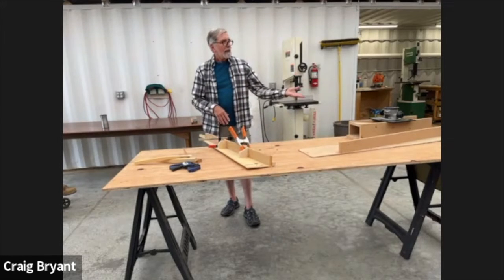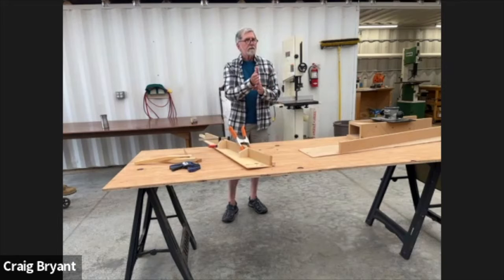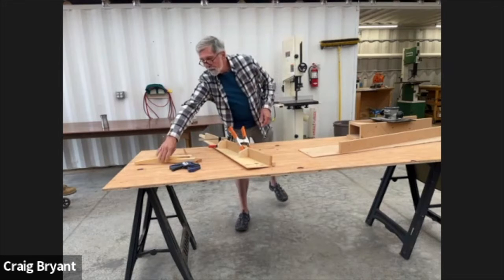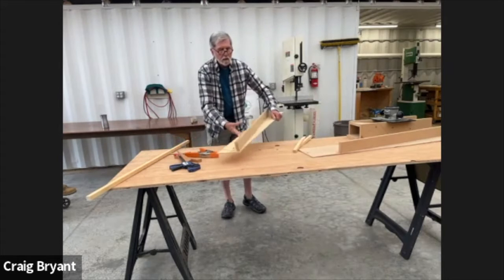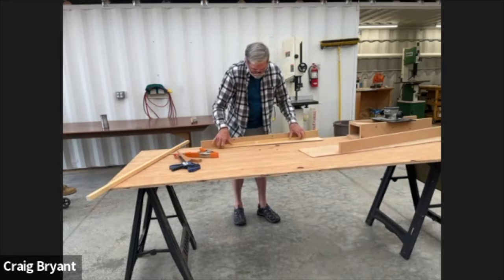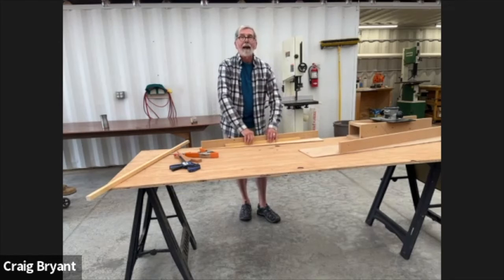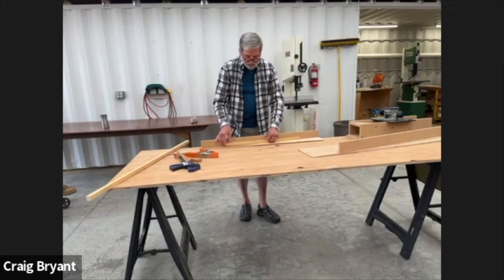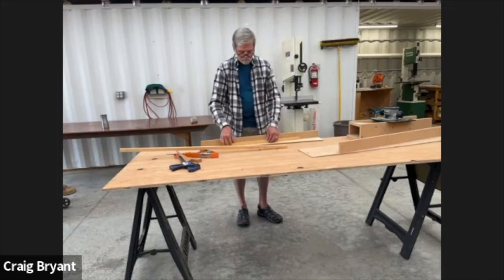And then I've got a jig that looks like this, where it's just a 90 base, and that's what I clamp my two pieces to align them. A piece that looks real similar to this, and then these two faces get clamped both down and to the edge, and that's what I use to align them. Because, like Mitch says, this little bit here means that it's going to do that. You're never going to like it.